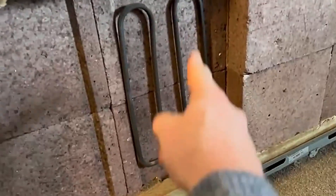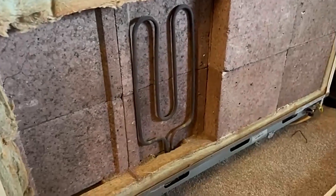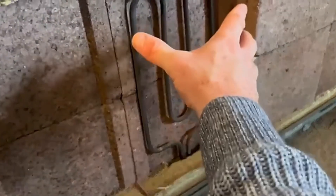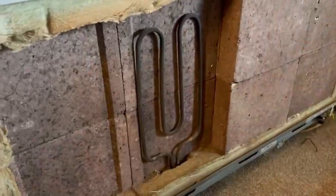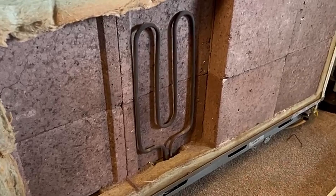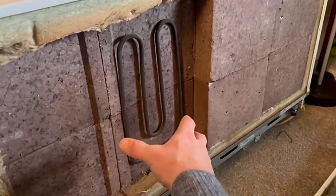The element is now in place. Just talking about how these storage heaters work: the element heats up and it's surrounded by bricks, which are then surrounded by insulation. These are called nighttime storage heaters - the element heats up at night on cheaper electricity, heating the dense bricks which hold the heat really well, so during the day the bricks are still hot.